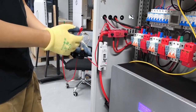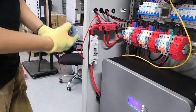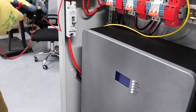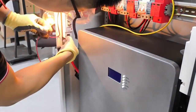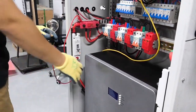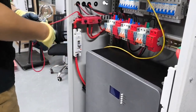When we connect here, pay attention to the light bulb — you can see it will turn on and light up. Then it gets dimmer and dimmer until it stops. When the light goes out, that means the pre-charge is already finished — no more current. So we take off the light bulb connection.